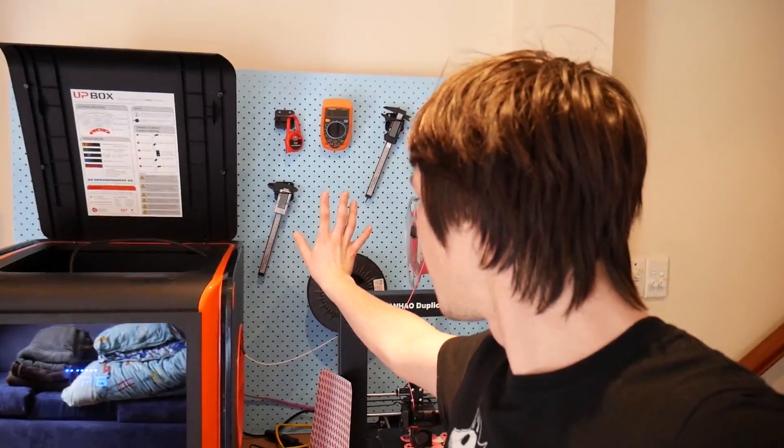I'm also printing in wiggle infill because I forgot to turn it off — that's a side effect of the infill video I did a while ago. Some of you will get wiggle coins if you come and say hi! Also, the Up Box: I had some issues before I went away with under-extruding and clicking. It turns out I just needed to readjust the extruder — it's now printing pretty beautifully in some kind of PLA.